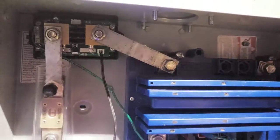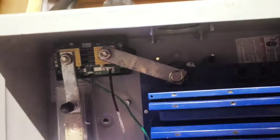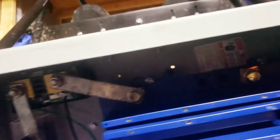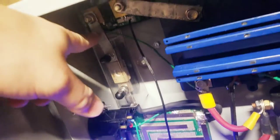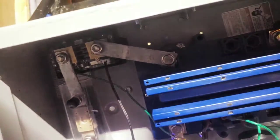Last time I was talking to you guys, I had not yet created these bus bars. Yesterday I went ahead and made them. This simplifies the wiring — I didn't need all the lugs, the sheets, or the heat shrink. With these, there are direct connections straight from bar to bar, point to point, and the fuses are right intact with them, so there's no flopping and no real possibility of them breaking out.